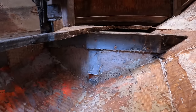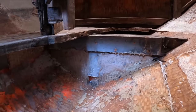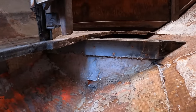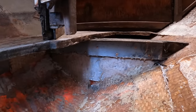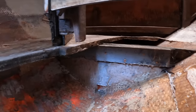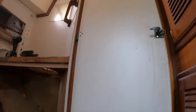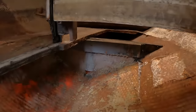That little rib over there is the last one to do on this side. We still have more to go aft, but this is the most forward rib and it's tiny, so we need to get rid of this floor that is on top of it. We're going to take these doors off to get some space to work on. Obviously it's rotten like the rest and the tabbing is not looking so good.